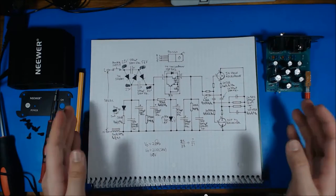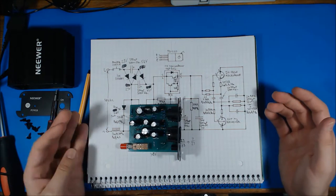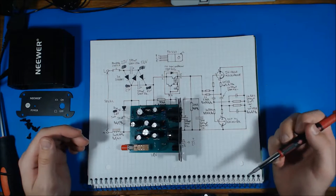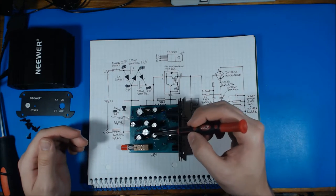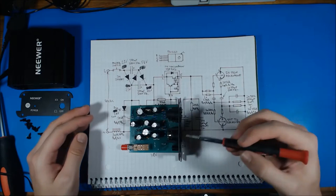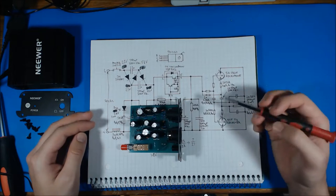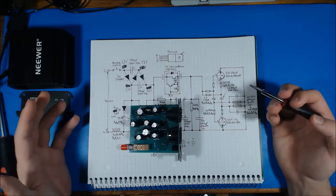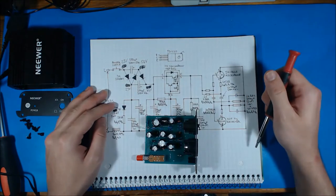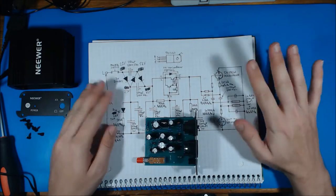This circuit is a lot simpler than I expected it to be but at the same time every bit as ingenious. The only thing protecting your audio equipment from 48 volts back-feeding to your equipment is just these two decoupling capacitors, so if either fails short-circuit your recording equipment is done for. I've got plans to build a hardware preamplifier for my microphone anyway, which will add another couple of layers of decoupling capacitors to protect my computer. I am just absolutely pleased by this discovery that it's powered by a Cockcroft-Walton voltage multiplier — this is brilliant. Anyways, catch you next time, bye.